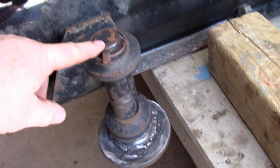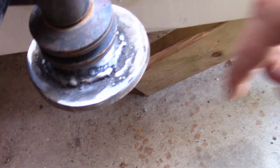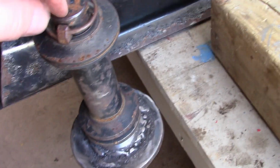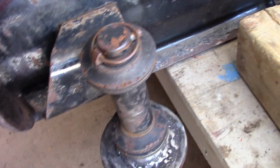This shaft ended up being, I don't know, a half inch shorter because of all the wear that was on the end of it. And now with the new scraper blade out here and the bigger shoe on here, this wear shoe, I had to put extra Bellevilles down here for spacers, and that made it so that it almost couldn't get the linchpin in at the top.